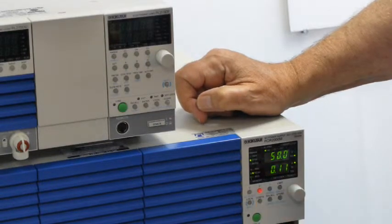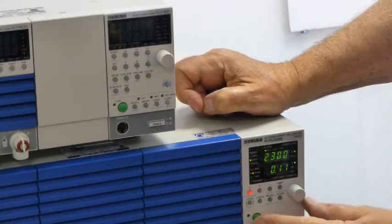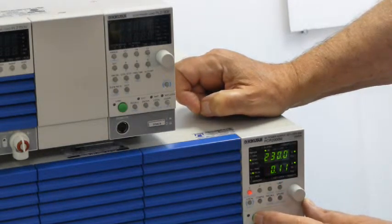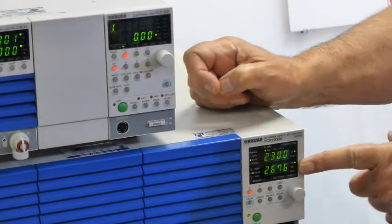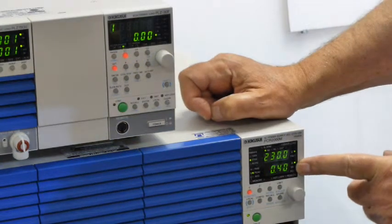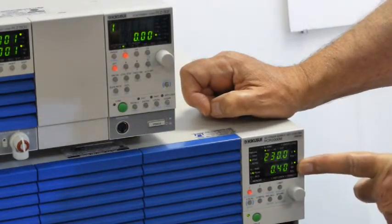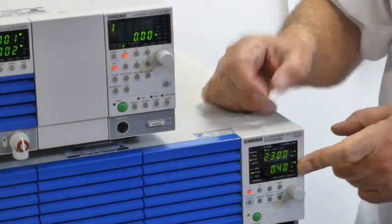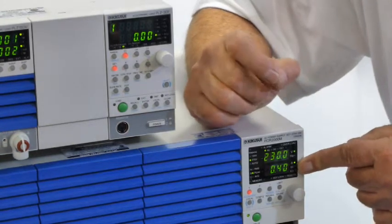So I think we're ready to rock and roll now. There's the voltage we're going to apply. Here we go — three, two, one. You can see here, nearly 27 amps of inrush. That's displayed for five seconds and then it drops back to 0.4 of an amp, which is the normal quiescent case. This electronic load isn't taking any load — it isn't doing anything, it's just idling.